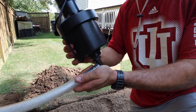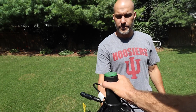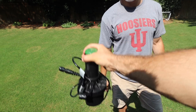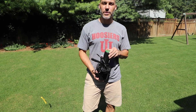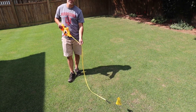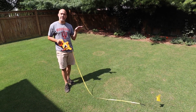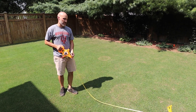It screws in at three-quarter inch and we recommend one-inch piping. When it's in the ground all you'll see at the top is just the head — just like a normal sprinkler head — safe and sound right in the middle. These heads can throw, depending on water pressure, around 30 feet in any direction at 60 PSI. I'm putting a pressure regulator on mine because I have 100 PSI at my house, which is too high. You want a max of 80, so the regulator goes to 75 PSI, giving me about 33 feet of throw.